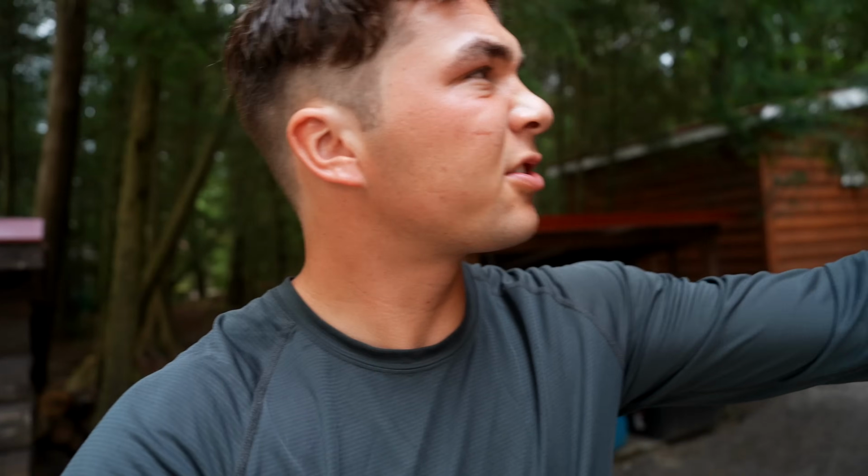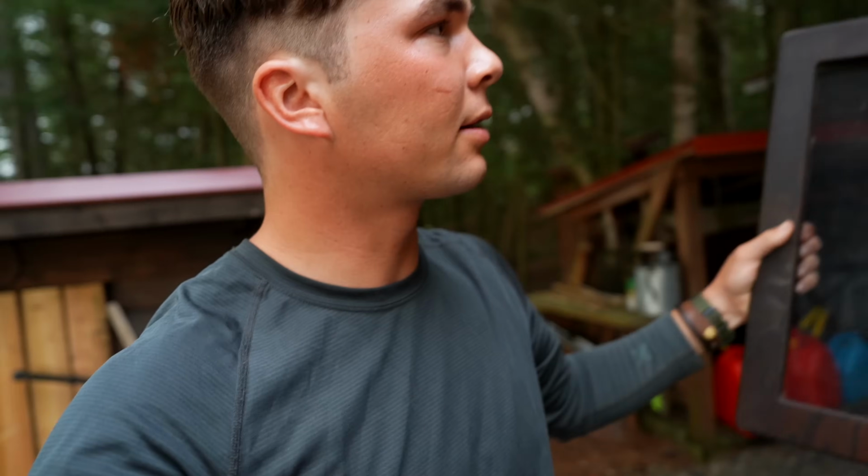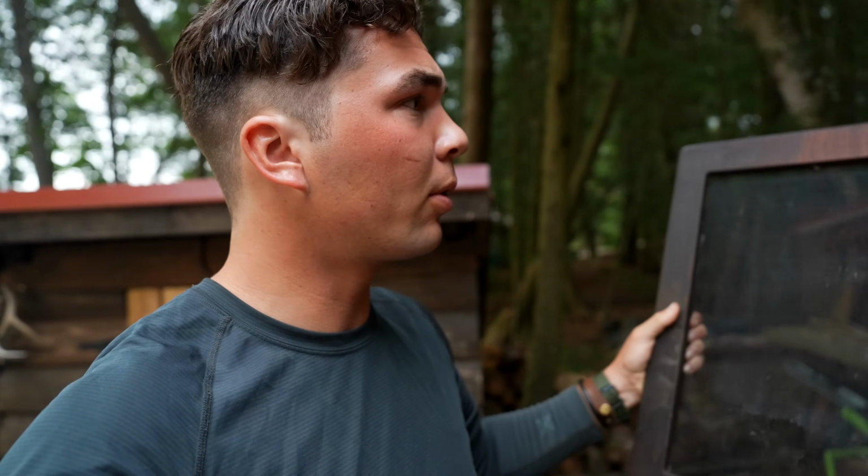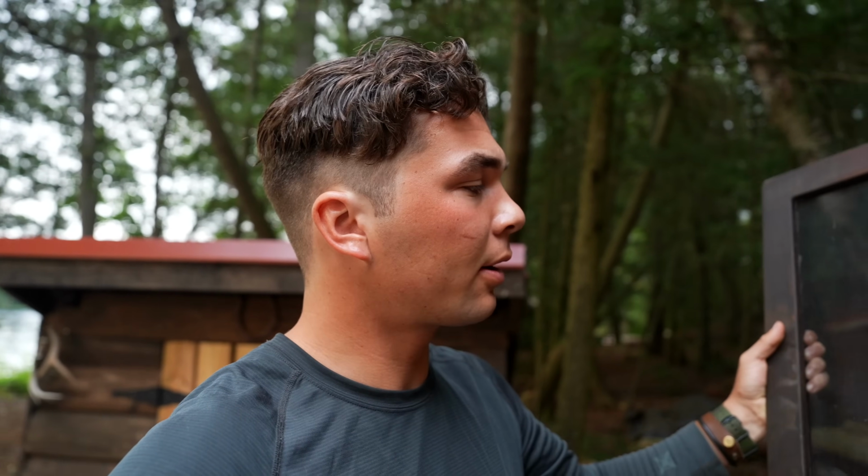I just did a really light sand, as you guys saw, kind of briefly sanded it and then gave it a wipe down with the oil. I'm going to probably put some more teak oil on here and then do varnish before dark and then tape the screen. So right now I'm going to run down and grab the tiller to my Laser, and with this one I'm going to do basically the same thing. It's just a repeat process, so I'll definitely speed it up, but sand it down, get it cleaned up nice. But this time, instead of the varnish, I'm going to try that urethane since I already bought it.